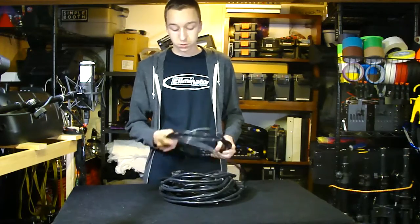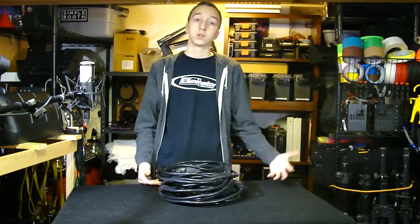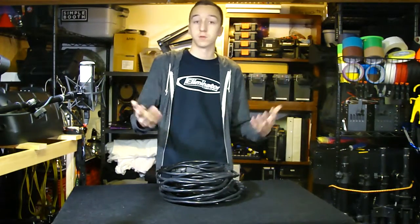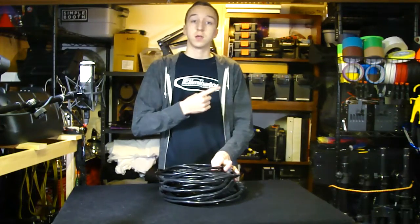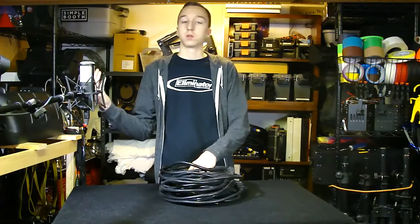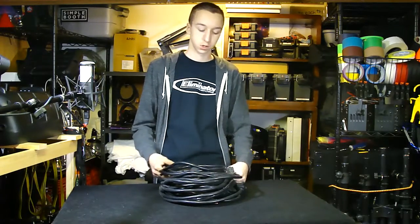A few ways I plan on using this: first, through a stick of truss. Say you get the 25-foot, you're doing a big theater production, you've got a 25-foot run of truss in the air with lights mounted every few feet. You can run this thing through the stick of truss and you have tap-outs for each of those lights to plug in along the way — a super easy way to distribute power through a stick of truss rather than using surge protectors and multiple extension cords.